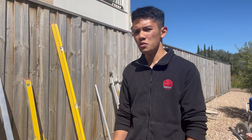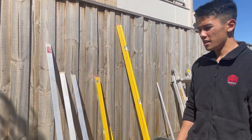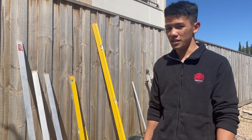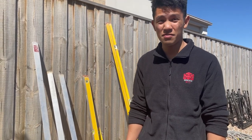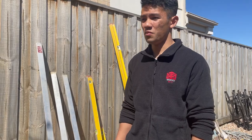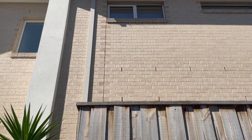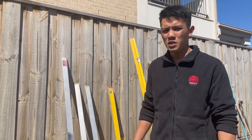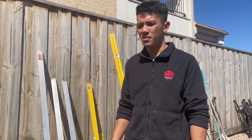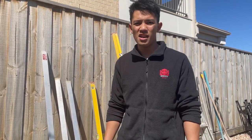These are expansion guides — there are three of them and they keep the joints straight and even. For example, you can see up there that's an expansion joint. What I do on the job site is put this in between as I'm laying, then take it out afterwards and clean it, so my expansion joints aren't wonky or uneven.